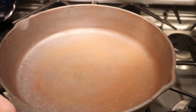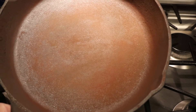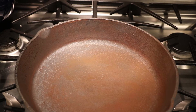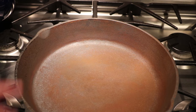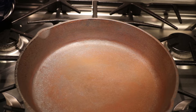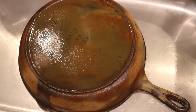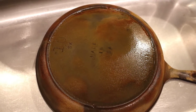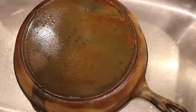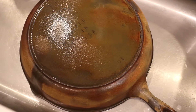So I'm going to hit this with some soap and some steel wool — quad zero grade, super fine. I'm going to get this cleaned up, get all the rust off as much as I can. I sprayed it with vinegar and water 50/50 about 5-10 minutes ago, and that's all the rust that's there. Holy cow. So I'm going to wash this off and see how it turned out.